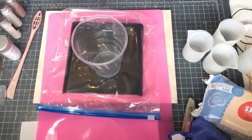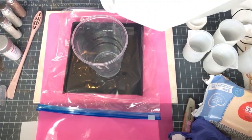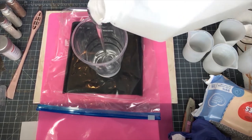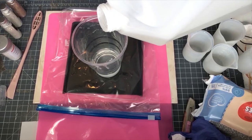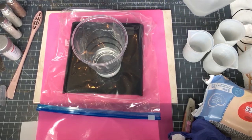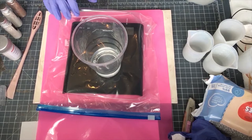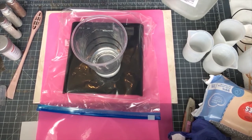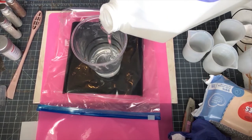I'm going to start today's video with just a quick word about how to measure two-part epoxy resin. Some people like to measure resin by volume and some people prefer to measure by weight. I like to use the weight option, however you do need to check the side of your bottle to see what it recommends. The resin which I use is called Total Cast by Elikem, and it's a one-to-one ratio resin, but it's only one-to-one if you measure it by volume.